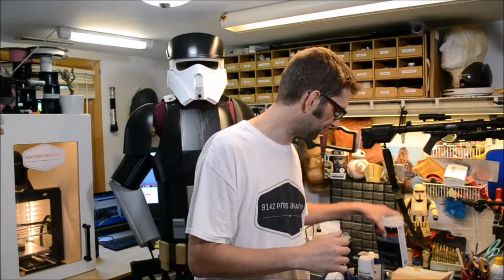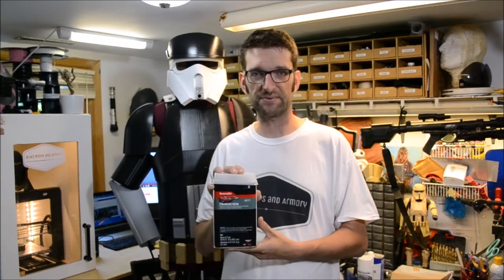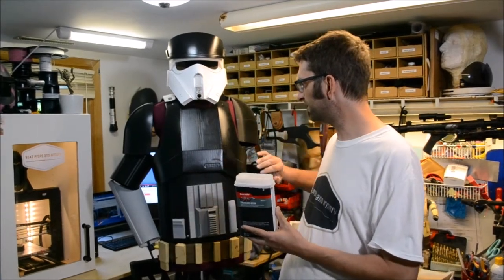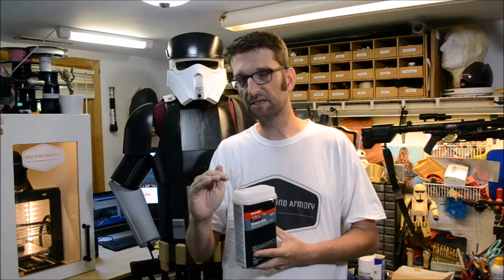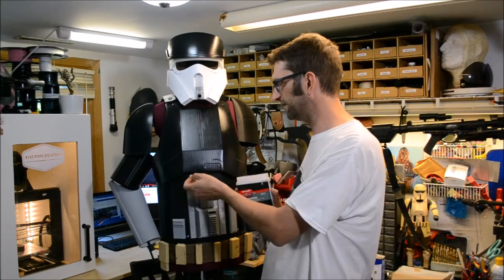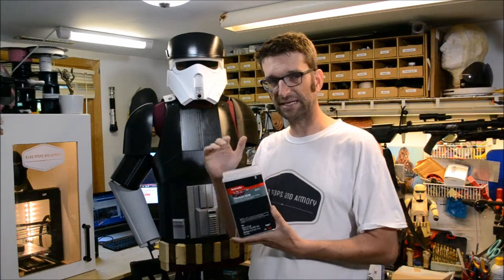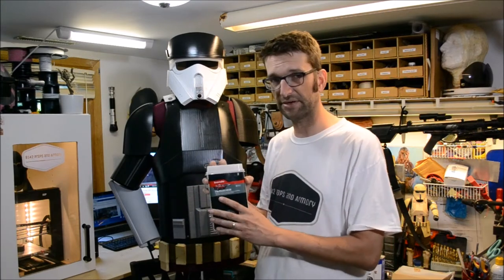The strongest way to do it, and one of the ways I'm going to show you, is using fiberglass resin. You can put fiberglass resin over the top of your printed parts - it will lay into the valleys in your printed surface and give you additional strength. I'm going to put it on the backside, and also on the outside of some pieces. When it's done it can be sanded, machined, and drilled. It is very tough stuff.